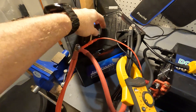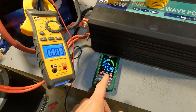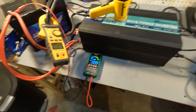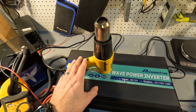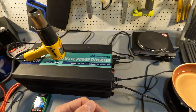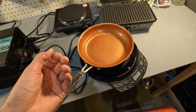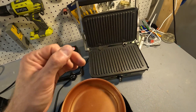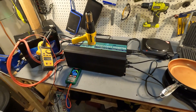Now let's go on to the high amperage testing. We have our Elfhub 100 amp hour 12 volt battery, an amp clamp, and a voltmeter so we can monitor both during the test. We have a 5000 watt MXMoon free inverter, a 1000 watt heat gun — actually maybe 1200 watts but it gives us right around 100 amps — a 1000 watt Elite Gourmet, a New Wave cooktop which can get up to 1300 watts, and a Gridlayer that can give us 1100 watts. Overall we should be able to pull 400 amps from this battery if it will let us.